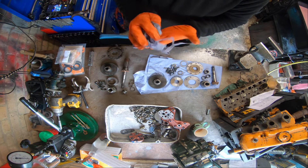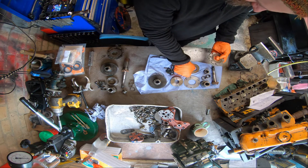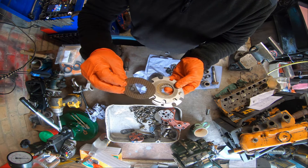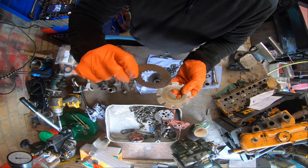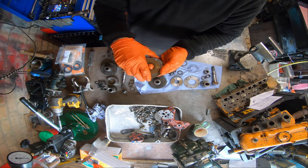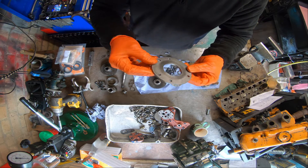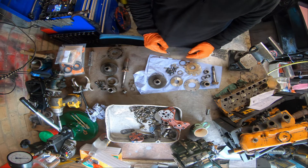In comparison, the stern or reversing gear clutch pack - this is what's come out as-is. As you can see, no discoloration. It's been used, but to my eye they're flat. I haven't actually put a straight edge across them yet, but the friction dry plate looks good. They're supposed to be interlaced. They're in good nick. They are serviceable. The customer doesn't want to spend a fortune on this - just wants it to work. I said to change the clutch pack seals and it will be all right for a while. The master plate is okay as well.